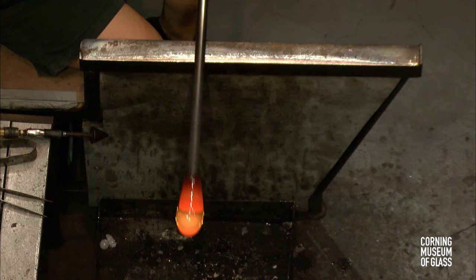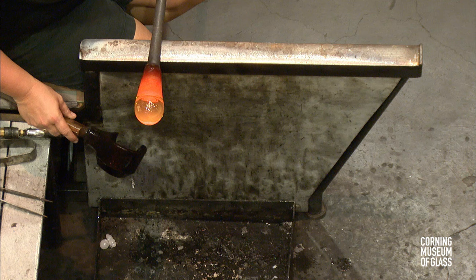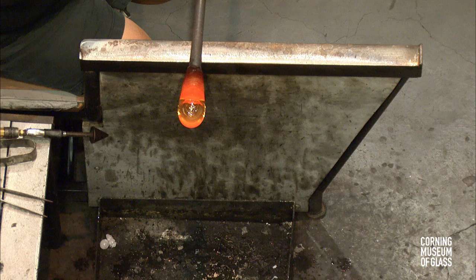So Catherine shaped and centered up that glass. Watch closely. She blew into the pipe, and just like that, a bubble appeared. So she blows into the end of the blowpipe, trapping air with her thumb. That air gets forced up that hollow stainless steel blowpipe and expands into the hot glass. So that's what we call our starter bubble. Every blown piece of glass you see up here was started in a similar fashion.